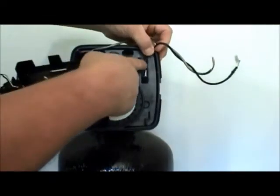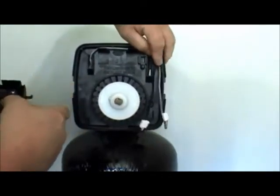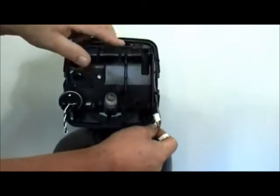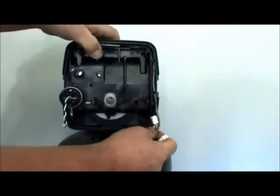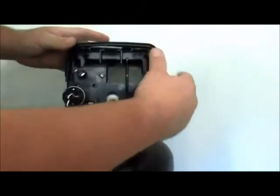It's very important before you start reassembling. Notice the cable there, it must be in the guides. It tends to fall out. You can do some damage to the cables if you try to put this assembly on without relocating those wires. Again, this goes down to the two bottom clips and snaps into the upper piece up there.